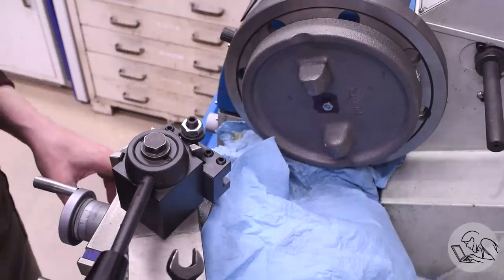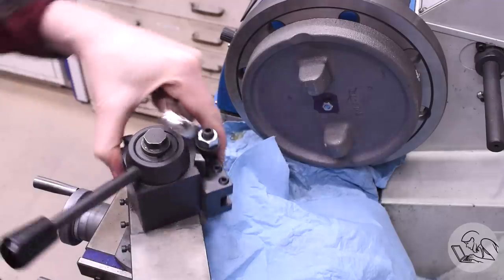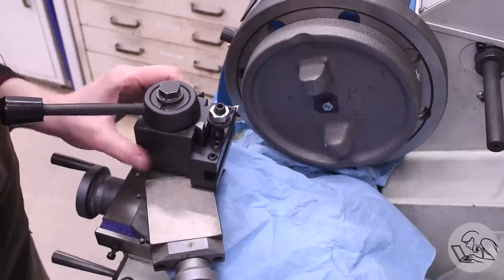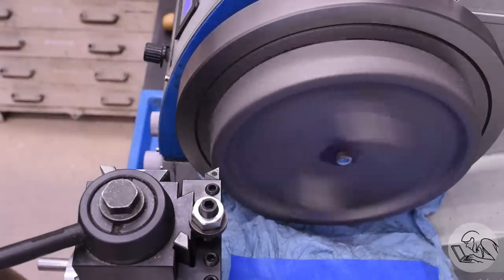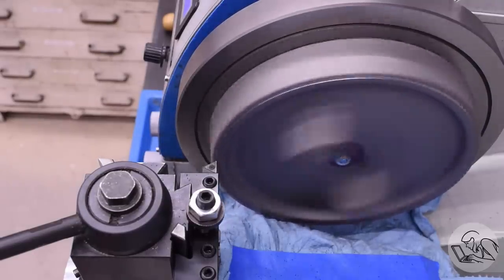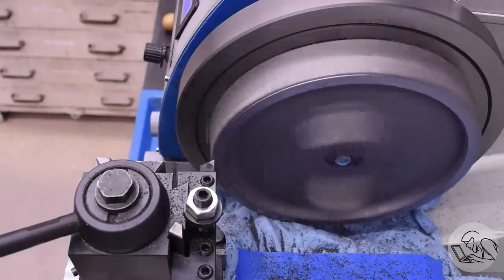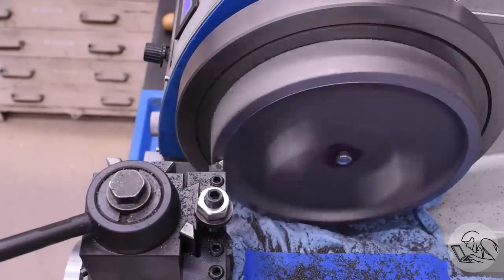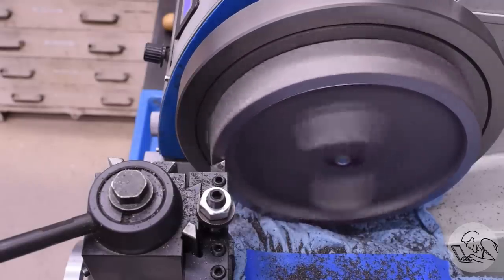Because of the large diameter of this part I'm going to need to do some compound shenanigans to get the reach required. If you turn your compound around facing towards you, you can advance it and gain more reach on a larger diameter part to get the tool far enough from the centerline to turn the outside. The first order of business is to clean up the bottom of that lip on the underside of the table — that's going to be the clamping reference for all subsequent operations. A parallel surface on the underside of a machine table makes it easy to clamp things and use as a reference — and it also looks nice.